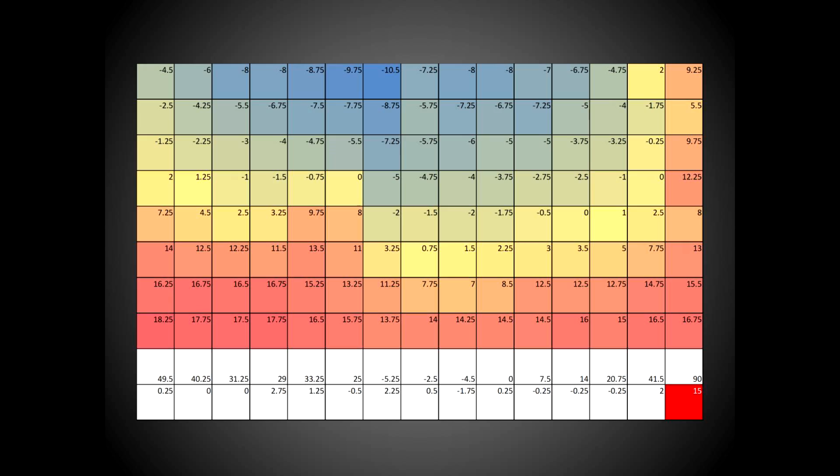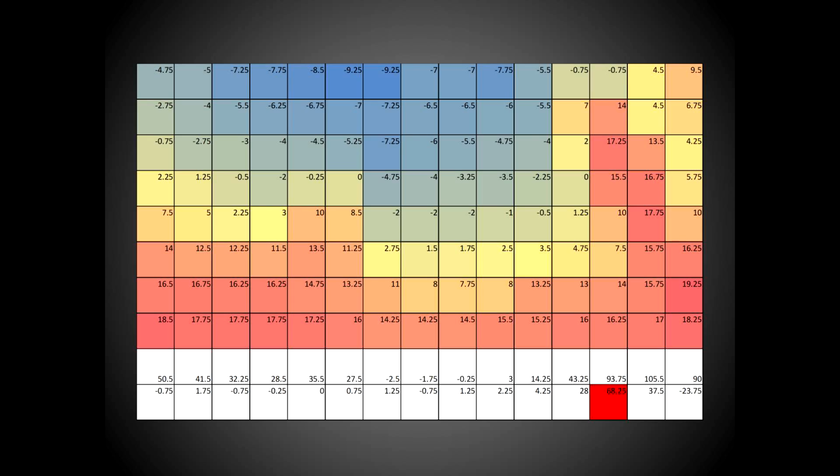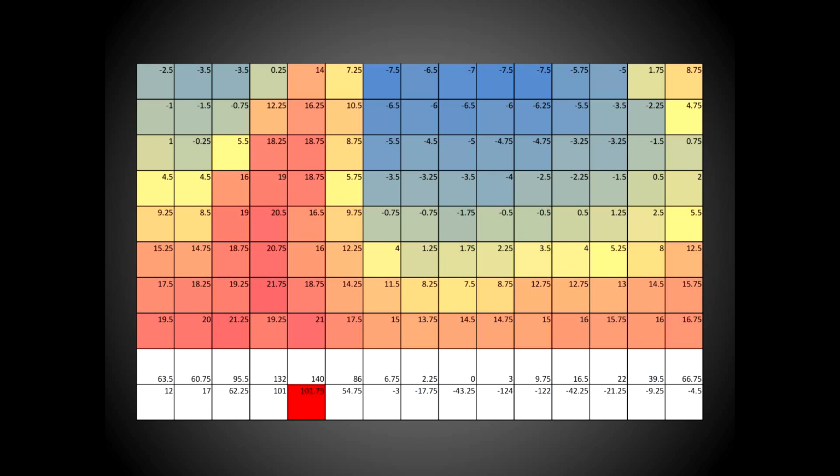Even as I just walk into frame on the right, the change is significant. Because of this, I also added a threshold, over which that change must be greater, in order to send a new position to the servo, and that removed all of the spurious motion.